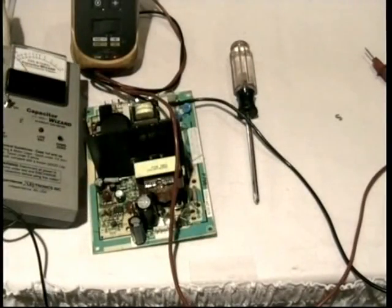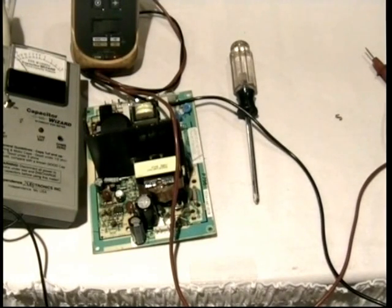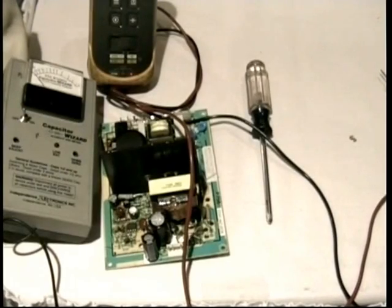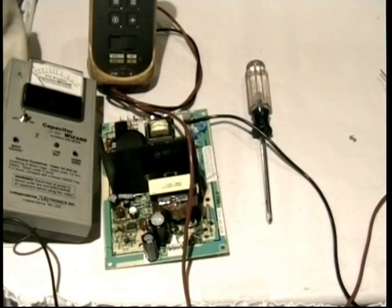I didn't bring it with me, but I have a giant bag at home that I usually carry with me, completely stuffed full, like Santa's bag full of toys, completely stuffed full of capacitors. And it cost $300, that's all. $300 for a year's supply of every capacitor you could possibly need. I think that's really cheap insurance. So I just throw in a new capacitor. Yes, I do test capacitors sometimes, but by and large, I throw in a new one.